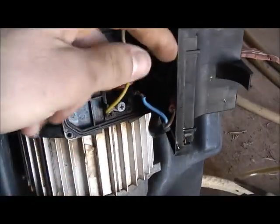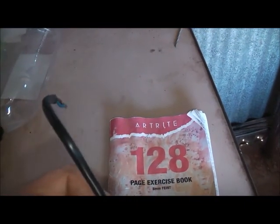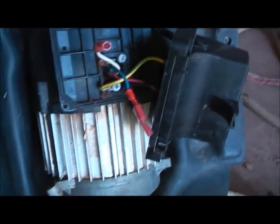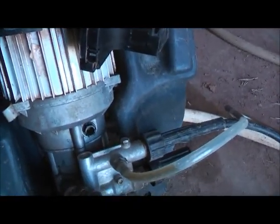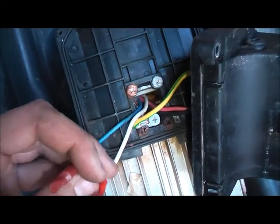So unplug that. I've written down the wiring diagram so I wouldn't forget, in that book. The book's always kept in here so we're not going to forget it. Let's check in this box — no water's got in here, that's a good thing. Good seal. I'll put this back together just to protect it, stop dust from getting in there in the meantime. I'll put those terminals on so they don't get corrosion on the motor connectors. The windings don't look too bad — they're not cooked in there.